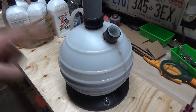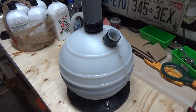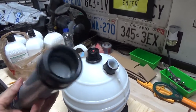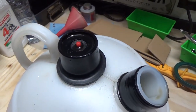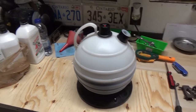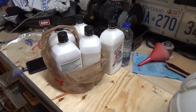You don't want to leave oil inside of this — they recommend draining it out as soon as you can. I'm going to remove the little one-way pump, wipe up the pump and the tip, then dump this into one of my oil storage containers and go ahead and measure out 3,500 milliliters of 10W40.